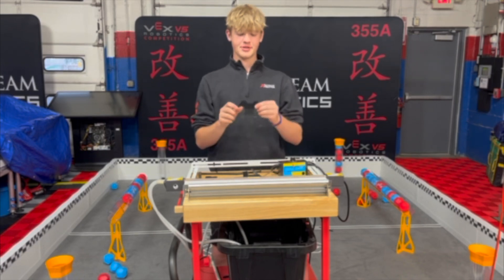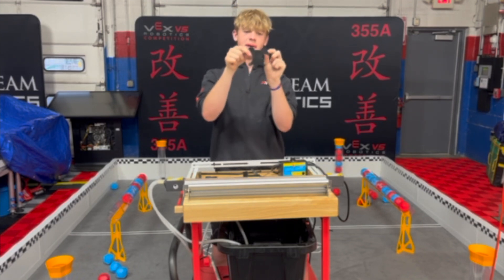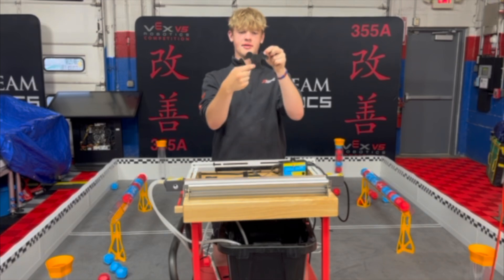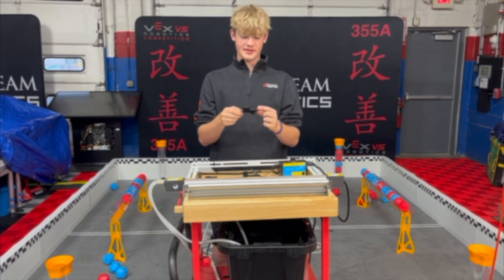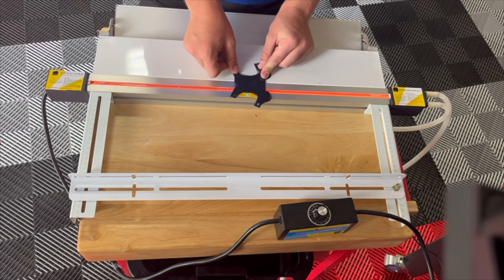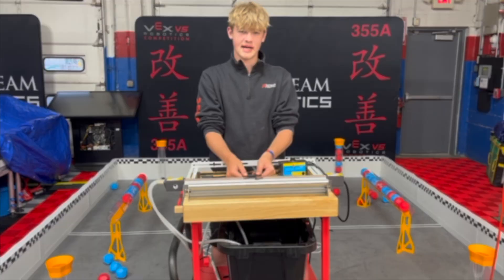So when CADing it, make sure that you have one side basically mirrored about the center line — the center line right here of your funnel piece that's actually going to contact the game elements. Then once you put it on the polycarb bender, you're going to put it from the corner here to the corner down here. There's a slight corner from this angle right here, so you're going to match those two up across the heating element and let that sit there and start to heat up. And then this is going to give you a really nice 90 degree bend.